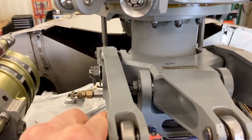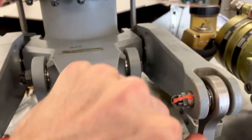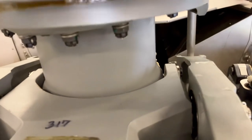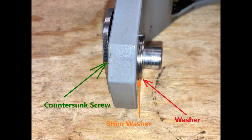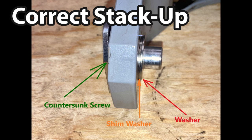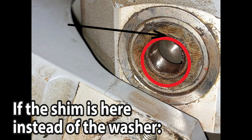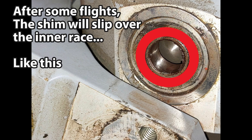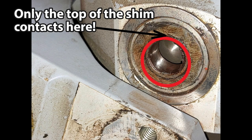On this job, the bearing block had a bad bearing and the hinge support had bad bushings inside the bearing block. Once all that was done — rigging done, shimming done — look at it now: you grab the cyclic levers or the front of the fork lever, move them side to side, and there's hardly any play at all. That's normal. You can check that on a daily. Also, even if you calculated the shim correctly but assembled it bolt-washer-shim instead of bolt-shim-washer, it may feel tight at first but after flying, the shim washer can sit down and catch the top of the bearing inner race.